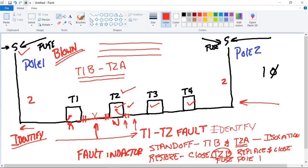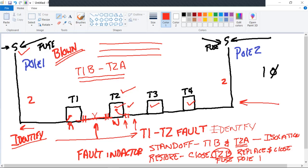We had goals for restoration of power. And it was a pretty big outage, probably about 500 customers in a subdivision. And they were using the fault indicator method and they were progressively restoring power through the subdivision and really not contacting anybody. They thought they had the correct line isolated, but when they got down to the last point to be able to close and re-energize another transformer, it was tagged incorrectly. And that went into alignment that was down the line. No communication. And it was a pretty substantial error. Communicate.